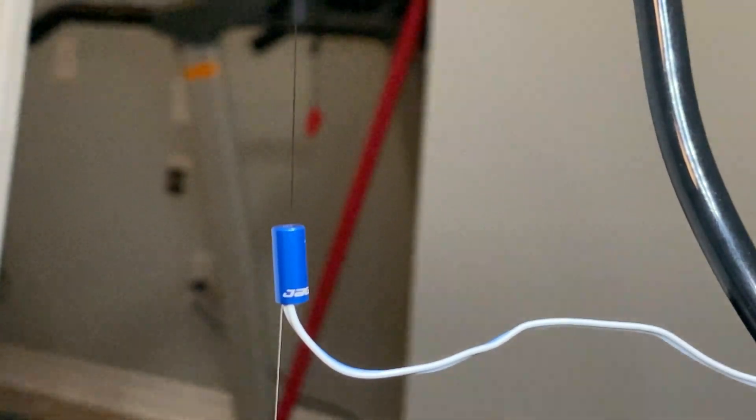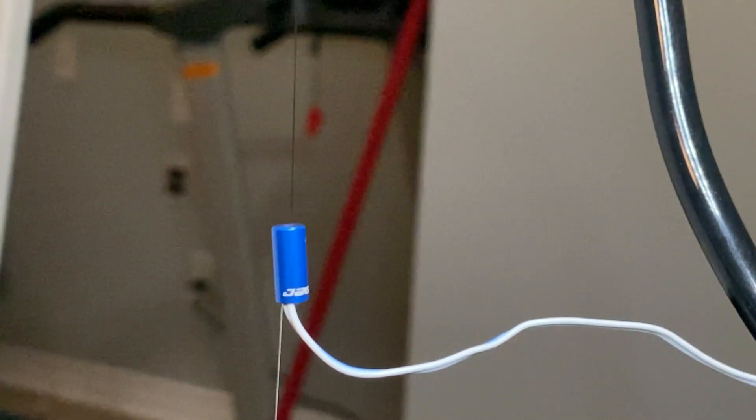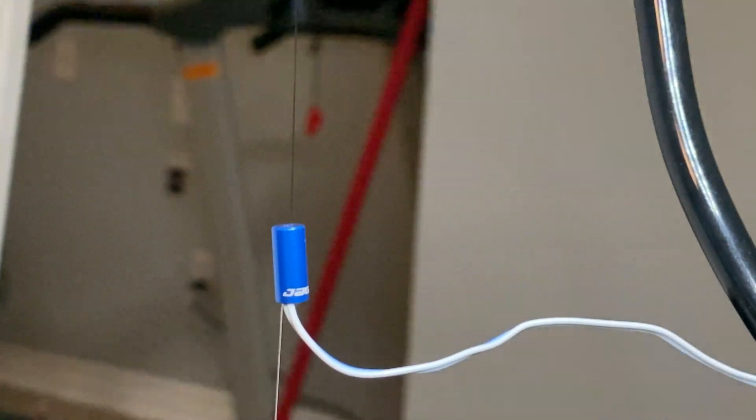There are quite a few examples you can find online and test yourself. One thing you might ask is: why don't they just use pyrotechnics? Well, for CubeSats that's not allowed. As an example, here was one of my earlier tests — just a rocket launch igniter in a little metal tube — and the nylon filament is wrapped through the tube to the top. As you apply a voltage, it releases and flashes through the nylon fairly quickly. But unfortunately for CubeSats, any pyrotechnics is not allowed. I wish it was because this is a lot easier than the proposed solution, but we have to work with what the CubeSat specifications allow us to do.